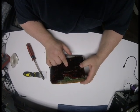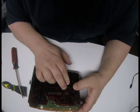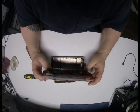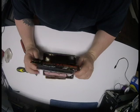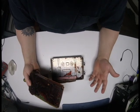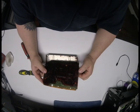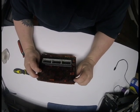That flash memory is right there — we're going to get to that later. The other thing is the injector drivers around the back here. There are different versions of this board, so some of the components are flipped around in different areas. But that's how you get it out of the aluminum case — heat is your best friend. Between 250 and 280 degrees at the most, nothing above 300, because you're going to start desoldering the components on here, and that's definitely not good.